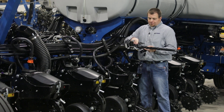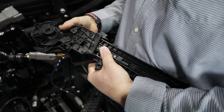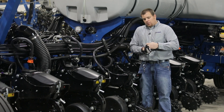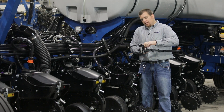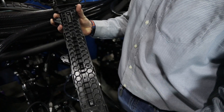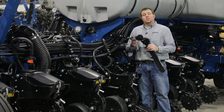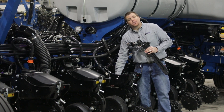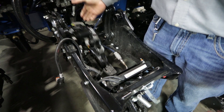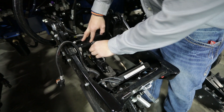So let's put this back together. We put our cover back on — again it aligns itself up, and you know it's in place because it clicks into place. We put our seed tube sensor back on; there are alignment tabs that ensure you have it aligned correctly. We put our retainer bolt back into the seed sensor, take our delivery tube guide, slide it in, click it back into place, and we're ready to go back in the row unit. Some unique items added to ensure the delivery tube goes into the right location every time: there's a rail system mounted in the row unit permanently, so when you install the delivery belt back, once you get it started, you can simply let it go and it will automatically align itself correctly every time.